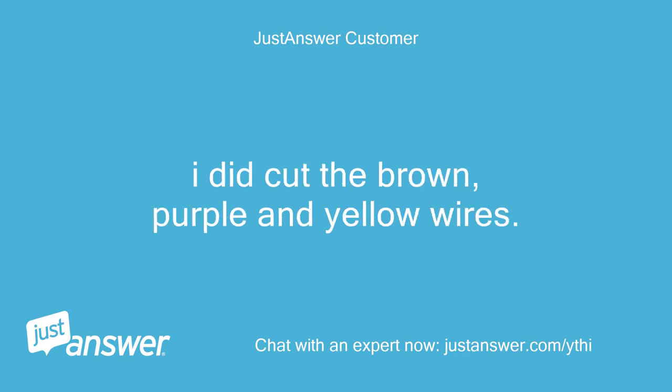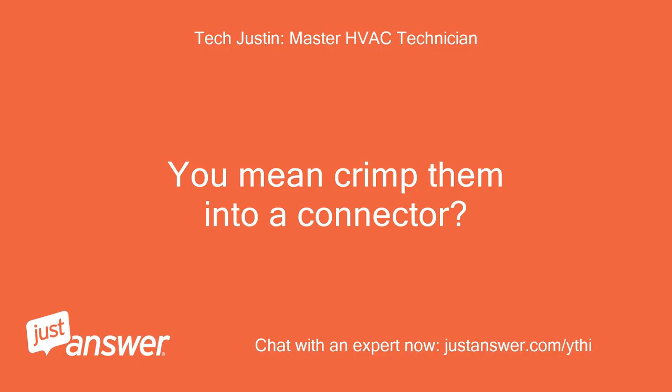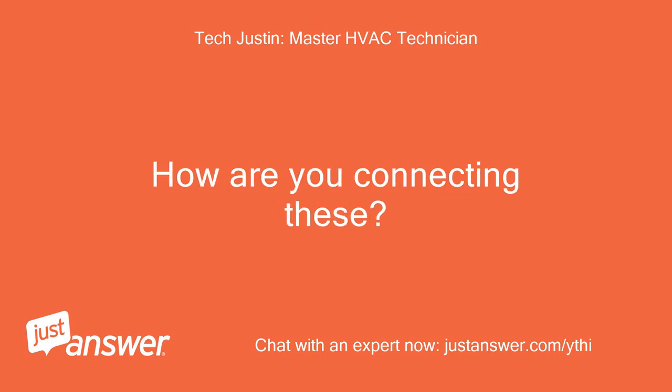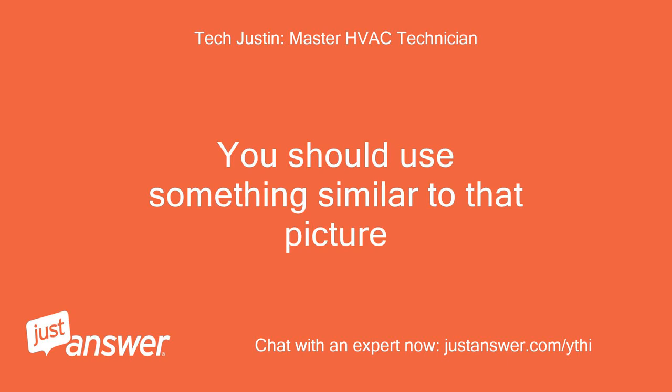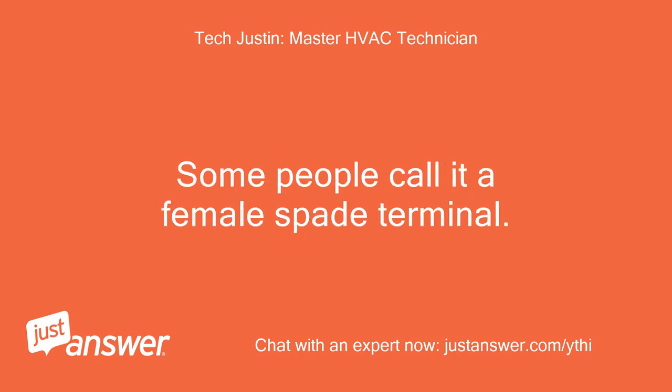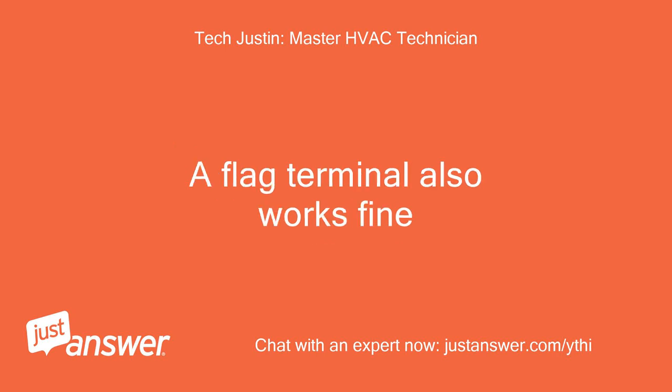I did cut the brown, purple and yellow wires. I'm assuming to connect them back to the capacitor you twist them through the hole and clamp them tight? You mean crimp them into a connector? How are you connecting these? Full-size image. You should use something similar to that picture. Some people call it a female spade terminal. It should look like the other connectors in the unit. A flag terminal also works fine.